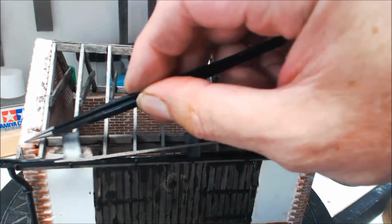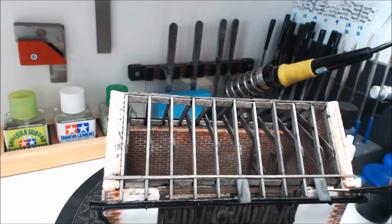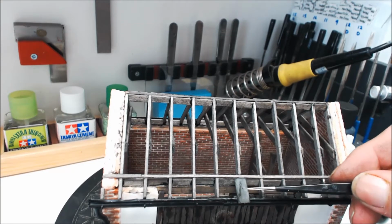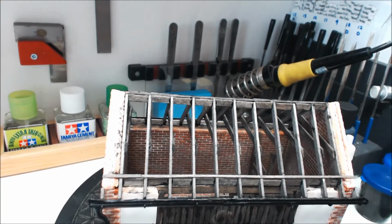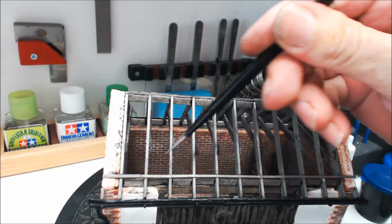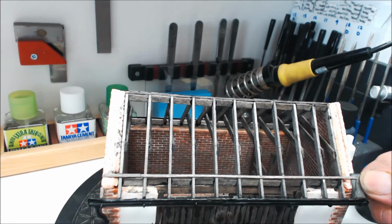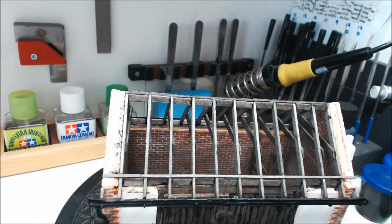I've glued my first batten across using the full tile as my gauge, which I should take out now. So that's our starting point. Now I've glued onto the trusses all the way through, but I've not glued the ends on. The simple reason is because we need to put a starter tile up underneath them battens all the way along. So now we need to put the battens on all the way.